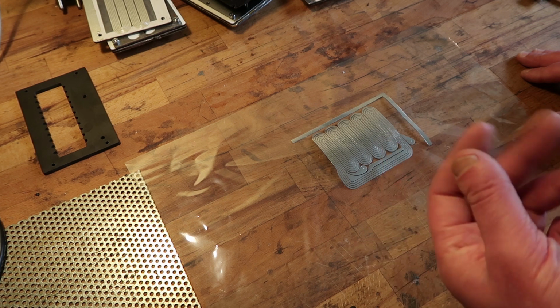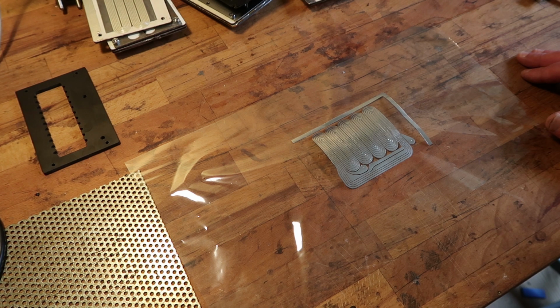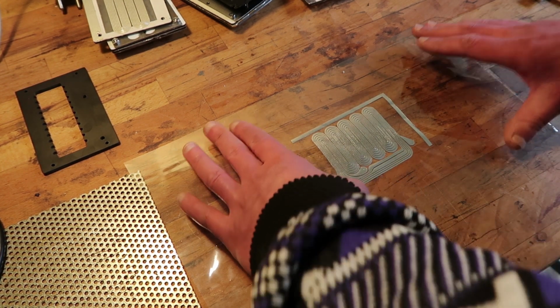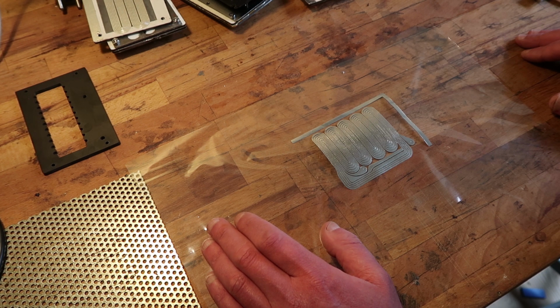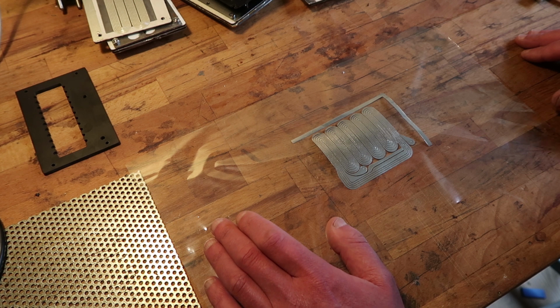I was thinking about SB Acoustics, this plastic driver. Sounds really terrible, but it is cheap and performs down low. Or the Dayton RS, but there's not much low in these RS drivers. At least in the 5-inch. They look really nice, aluminium basket, etc. Very, very nice drivers, but I don't think there's gonna be any low end to be able to have a monitor that has some low end. The SB Acoustics also don't measure all that nice, but they are more efficient, and if you get rid of the 500 Hertz thingy, which I have to do anyways because of the baffle, I think they could be used to play rather lowish and rather flat. But yeah, not at 98 dB or something.